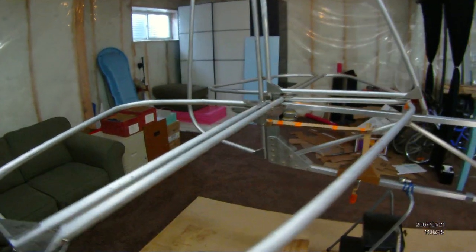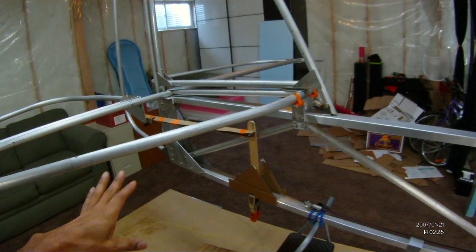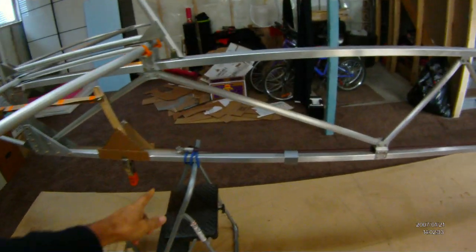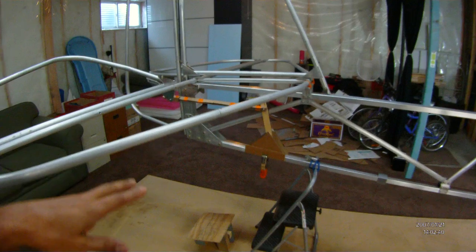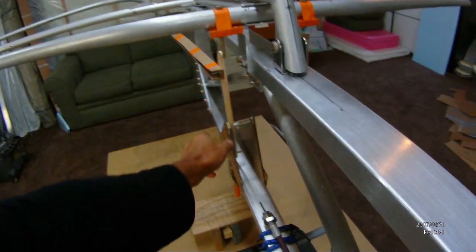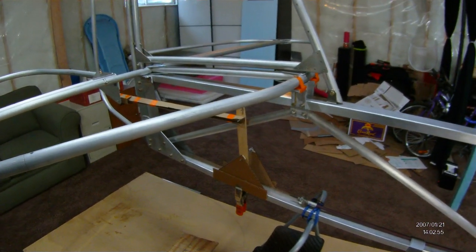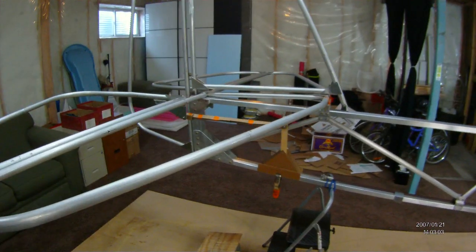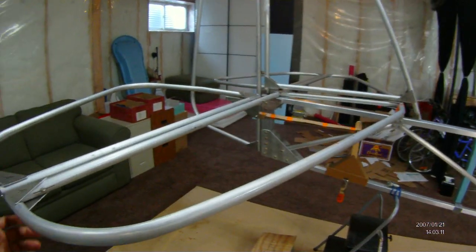We've got our elevators, and this is just my rudimentary bell crank. I mocked up a lot of things since the last video in cardboard and plywood — cheap stuff to work with. This is how my elevator bell crank will work once I tie the cable in. The cable end is missing; I had to cut it off — I'll explain that in a second. It's going to have two bell cranks that are bearing-supported as per the plans. I have to order the bearings from Aircraft Spruce. I also made some splices where I'd run out of tubing, spliced them in with rivets and epoxy — I'm happy with it; it's pretty rigid.